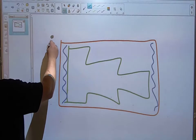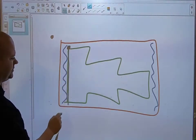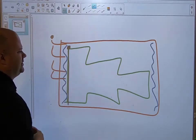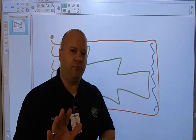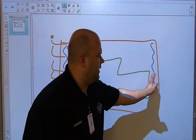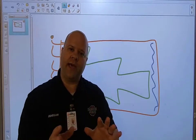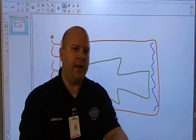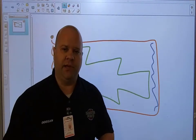I'll be at my clear point at one hundred thousandths bigger than my diameter, and my Z zero for the finish is going to be that face. The tool path will come in and face it all the way down. Once that's done, I've finished Op 1 with G54 and successfully removed one hundred thousandths off my part, leaving one hundred thousandths on the other side. If you're using the same jaws and the same stop, all you have to do is move your G55 work offset an additional one hundred thousandths.